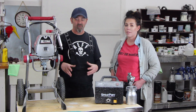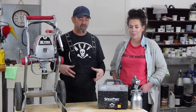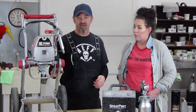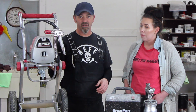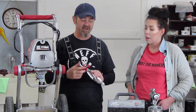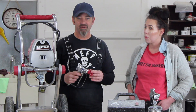I wanted to talk about the equipment a little bit. We've switched over from the airless sprayer to the HVLP sprayer and I thought we'd just talk about what we're actually using as far as equipment goes. The airless sprayer that we're using is a Titan XT330 and I've got an LX60 gun on it. This is a consumer-grade, midline airless sprayer — it produces 2,200 PSI, so it's not a professional grade. It's using a 517 tip like I said earlier. The five indicates your spray pattern size — basically 10 inches — and the 17 is your orifice size.